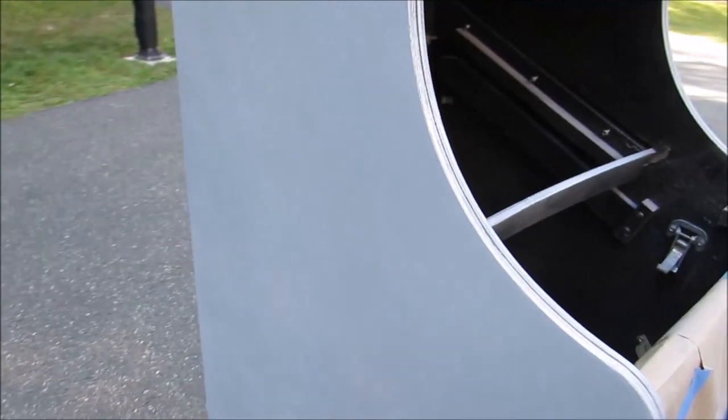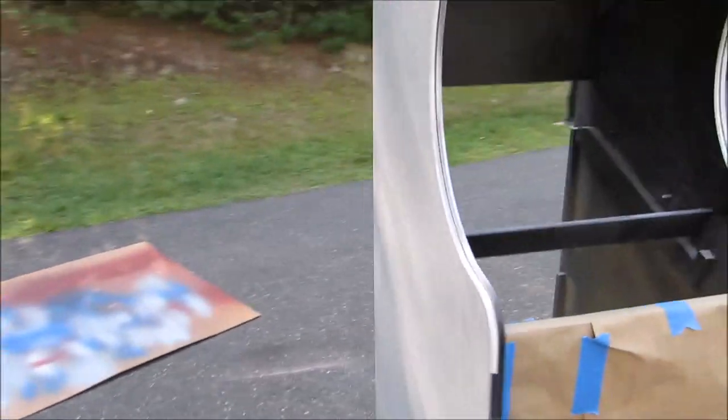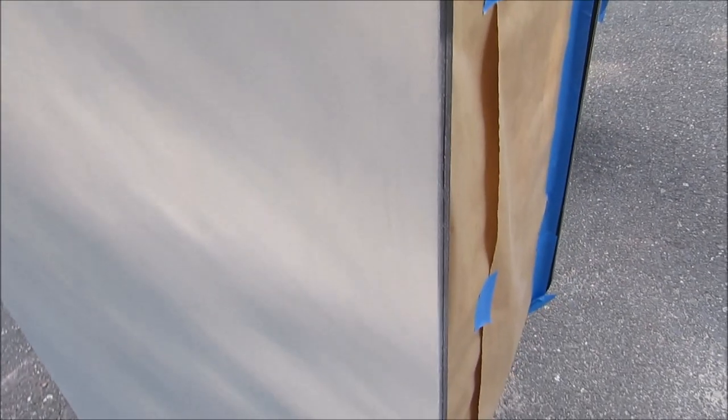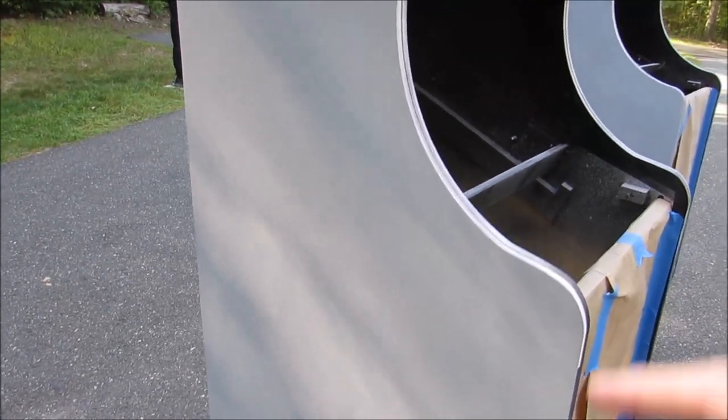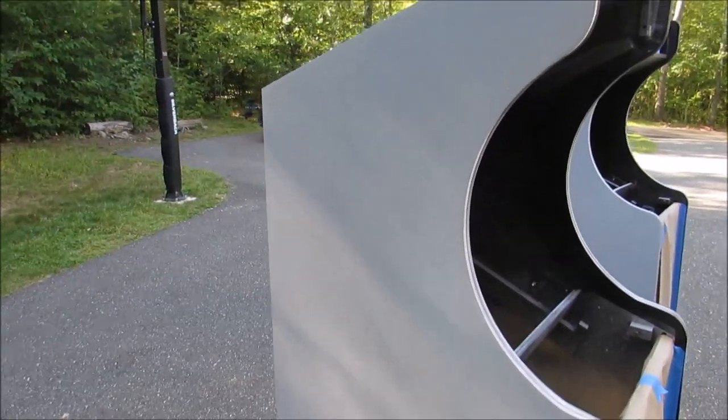I'm not doing a skim coat on here, but we've done filler primer, and as a result, there's still some planking. My cabinet is doing fine on one side, but the other has very faint gouges — almost like the belt sander chewed up that spot. I'm going to put a little spot putty in there. So the plan is: spot putty, let dry, sand, clean up, filler primer, sand again, then we're ready to paint.